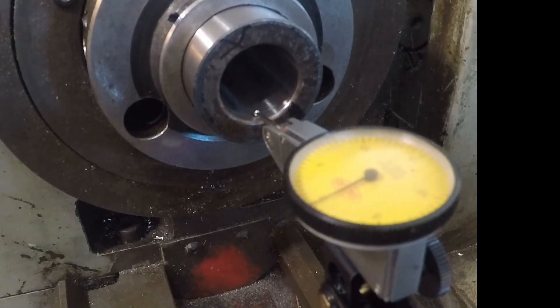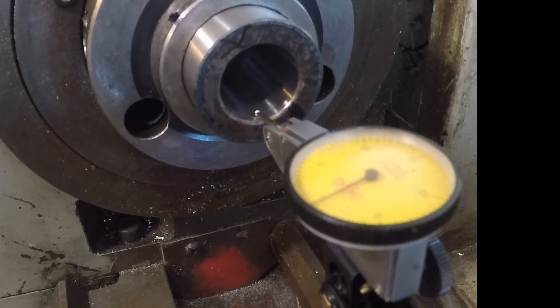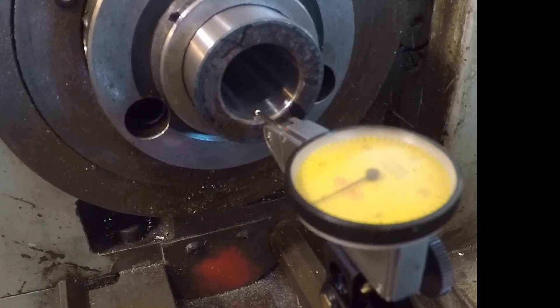With the way it's seated — no drawbar, just tapped in with the little Mjolnir hammer I picked up off the scrap yard — it looks like we're getting a couple thousandths of runout. By the time you extend it out, it's going to be a little bit more. The whole reason for this is turning between centers. At least I've got something in there and can do something. It may not be perfection, but if I'm turning between centers, we'll see. A little disappointing, but it is what it is.